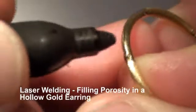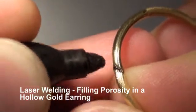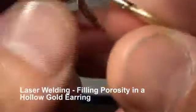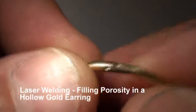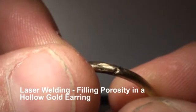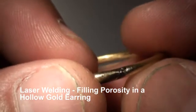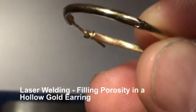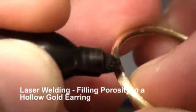We're going to take out our trusty marker and mark it first — marking just the high points. And if we don't get good homogenization, well then we're going to rethink our settings. We've got some flow there, but I'm going to juice it up a little bit. We want all of this to come together as one piece.